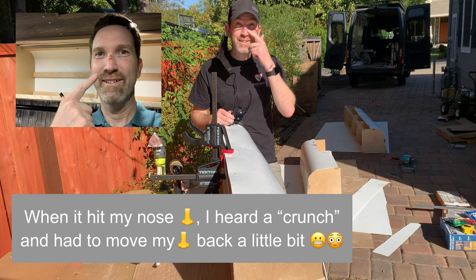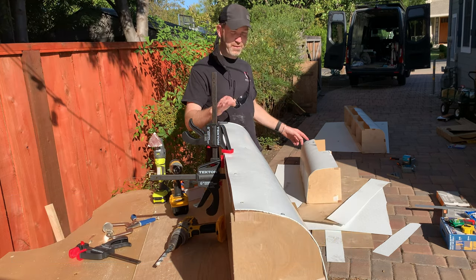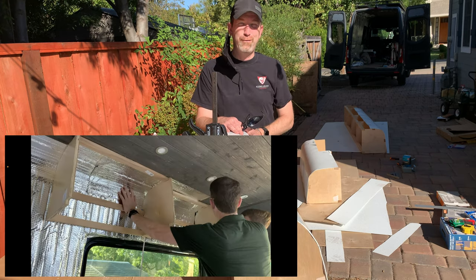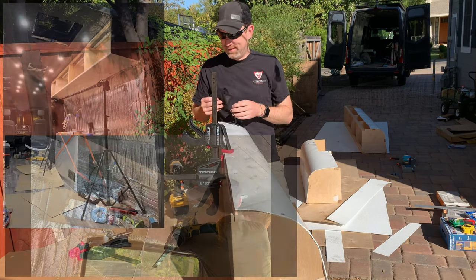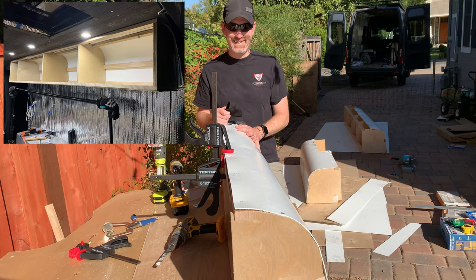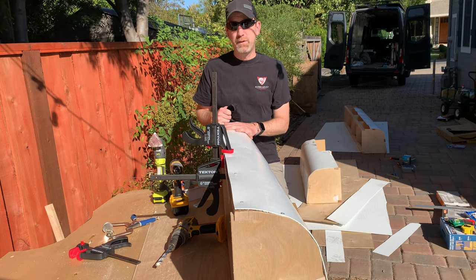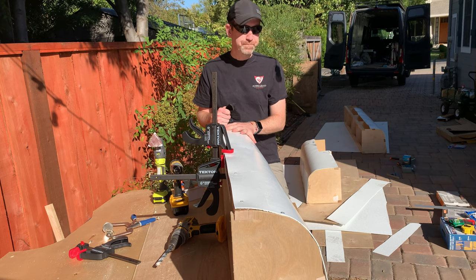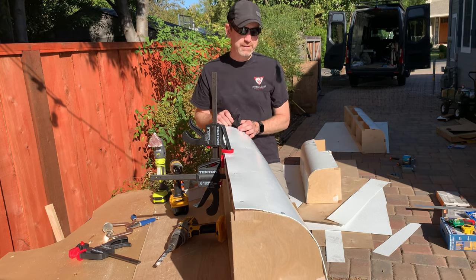Actually, you see my nose? I was trying it by myself, with the smallest one, and it fell forward and cracked me right on the nose. So I guess I'm putting blood, sweat, and tears into this project. Anyway, if you make the holes a tiny bit bigger than what you need, it gives you a little bit of play, which I think helps a lot. That helped me. I'm talking about the holes that the hardware is going to go through into the plus nuts.